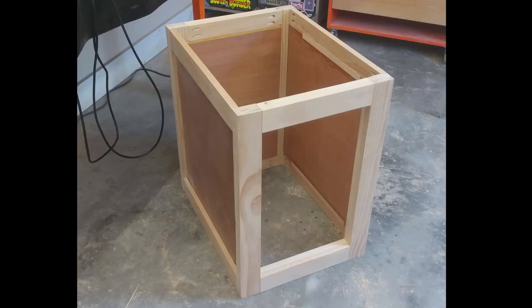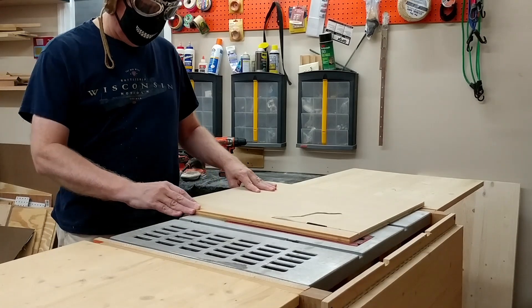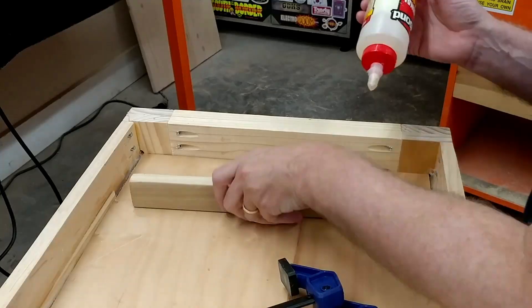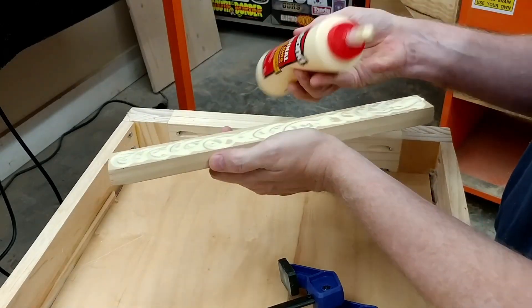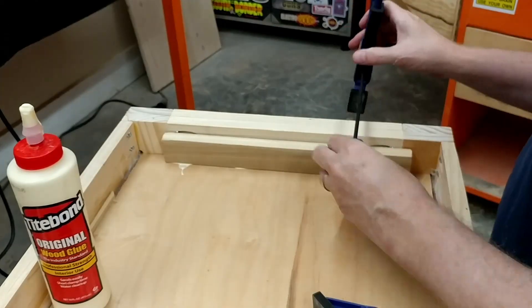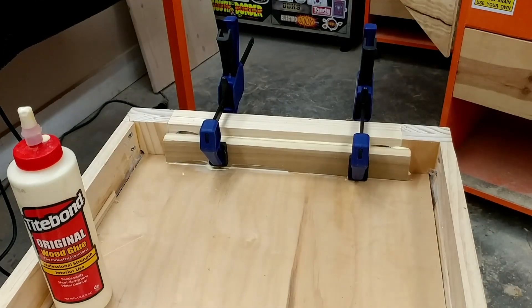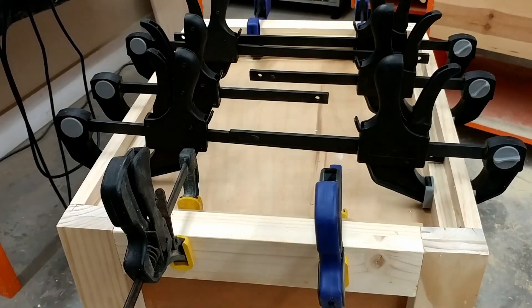It's been a few days and I've got all the clamps off, so let's get back to it and get this thing built. The sides and back are in place, and all the structural pieces are screwed and glued together. Now it's time to cut the bottom using half-inch plywood. The supporting structure for the bottom is hidden, so I pulled scraps out of the scrap bin and attached them to the bottom. Nobody's going to see this, so it doesn't matter how ugly it is — and it's a good way to use spare wood. Also, you can never have enough clamps. That's a rule.